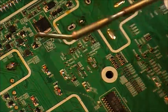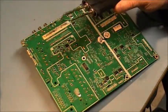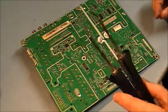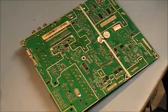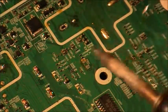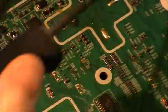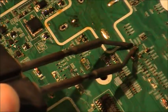The expert method is to use a surface mounted tool. I've got the tweezers on it and clean it up a bit. I normally start by freshening up the solder, then with a pair of tweezers it lifts right up.